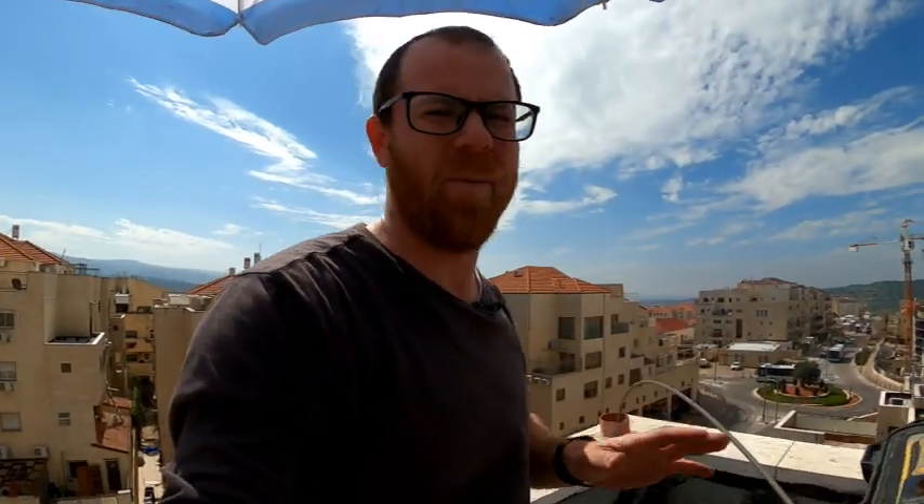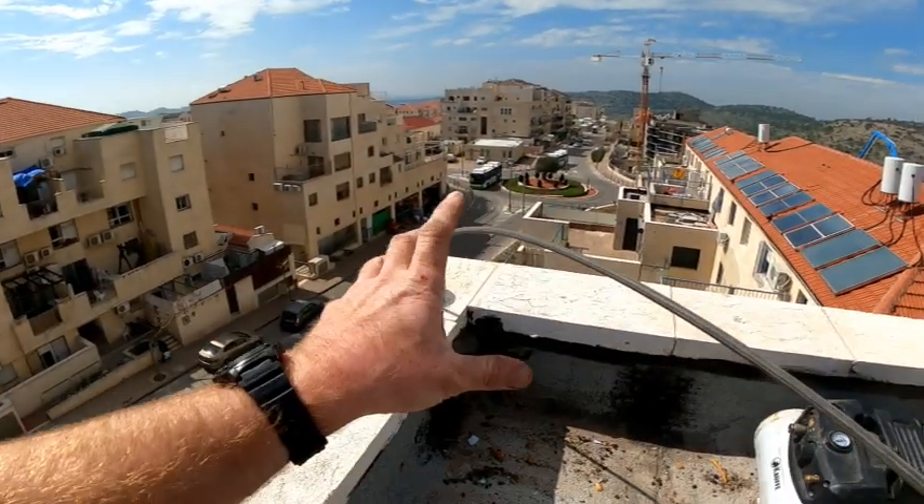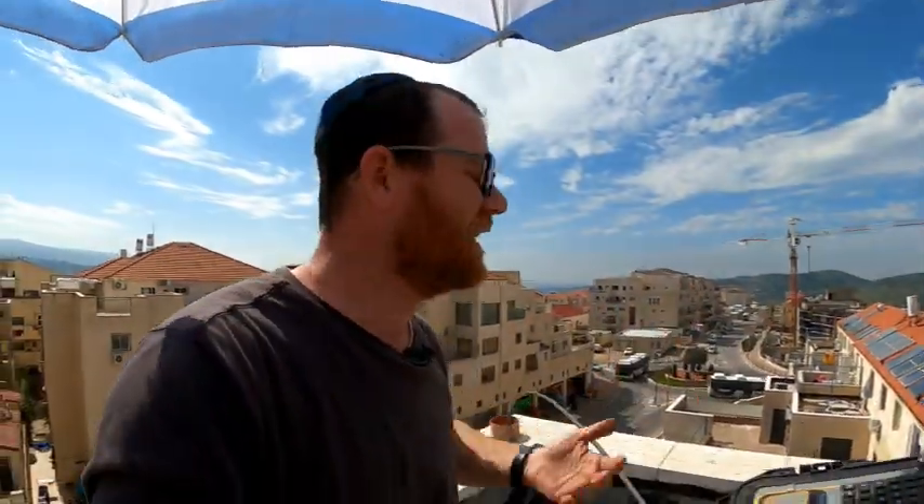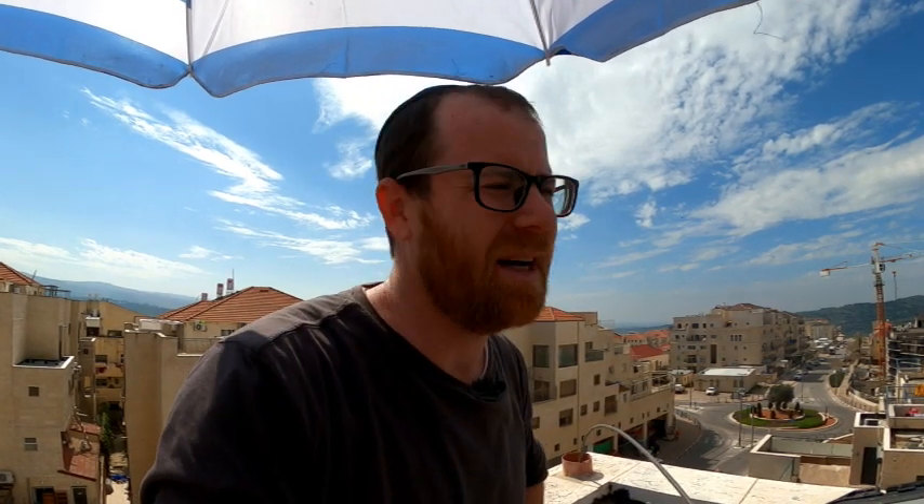So let's explain what happened. Elite Specialist told me 5.7 meters down you're going to have a weld that failed. Generally in HDPE piping we're talking about electrofusion. Now I get to that point and I see it's a butt weld, not electrofusion. And I look with the camera - it looks pretty good. I said I don't know about that. So I did some testing with the balloon - put the balloon in, fill up with water, and I didn't see any issues. So I got suspicious.